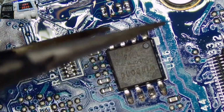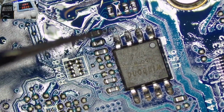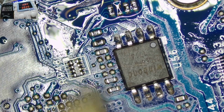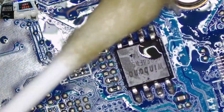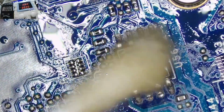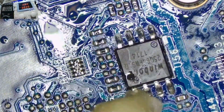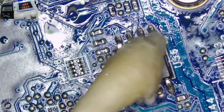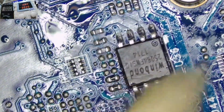Okay, I think so do you think now we will have a good laptop here? So I'll just try to put it on and see. Let's cool the chip. You see, when you're cleaning the area with alcohol, the chip will also cool down because as the alcohol is evaporating very quickly, there's some cooling effect on the motherboard. I don't know whether you have seen that thing with the spirit. You pour spirit on your hand and then you blow it, put some wind through your mouth and see the cooling effect. It's the same here with the motherboard and this alcohol.